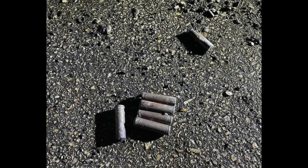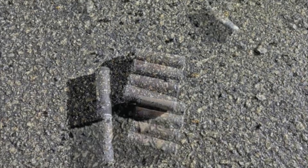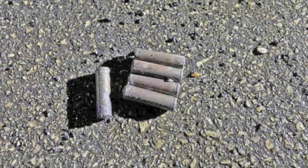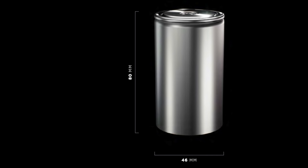I imported the image into Photoshop and tried to measure each battery to gather the dimensions. The different batteries are called different form factors, and the names they carry are related to the different size of the battery can. For example, 4680 is a 46mm diameter and 80mm height. I am not able to measure these batteries in millimeters as there is no relative perspective, but if you divide the diameter into the length, you get a ratio difference between diameter and length, and everything should be in proportion.